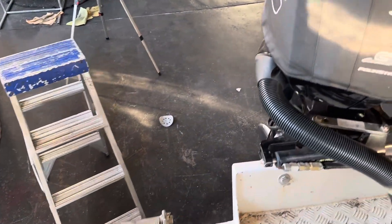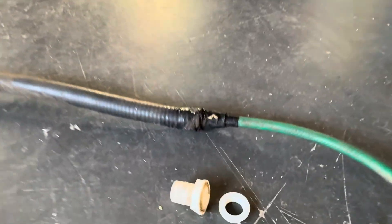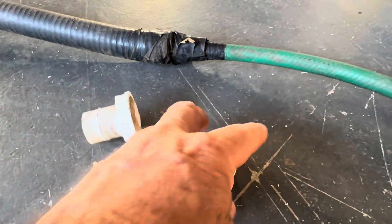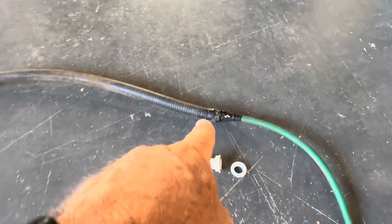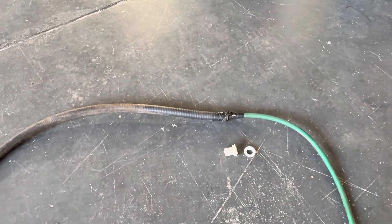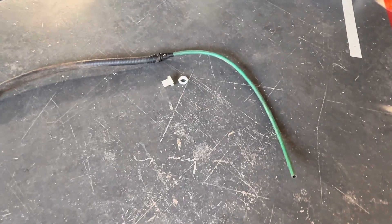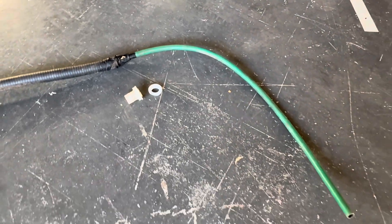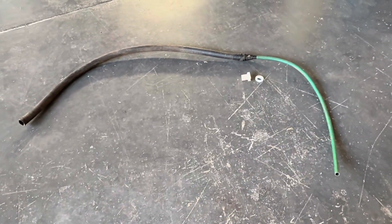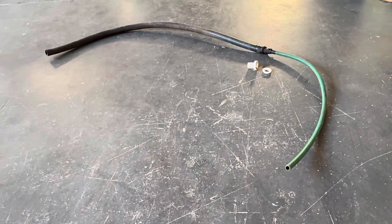Sealed decks are fine as long as they're sealed. Here is the culprit — this is the plastic flange fitting which goes on the inside of the boat and then screws on from the outside, and it's snapped in between. The hose that goes down to the bilge pump has snapped off the side and dropped into the hull, so it was just recirculating the water in the hull. Because they couldn't get in there, they were only able to grab the hose and put some tape on it in an emergency and stick some garden hose over the side of the boat — moments from disaster.